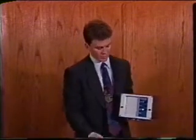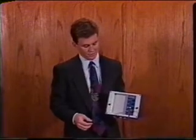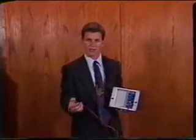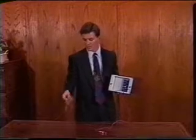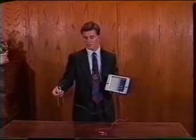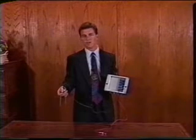The Model 902 transmitter will energize pipe and cable in two ways, both directly and indirectly. For direct hookup, take your direct connection cables and plug them into the direct output jack. Turn the instrument on, take the red lead and connect it to the pipe, cable, or tracer wire that you would like to trace out. Take the black lead, connect it to the ground rod, and push it into the soil. The Model 902 transmitter must be grounded for direct connect locating.